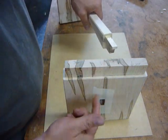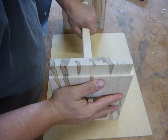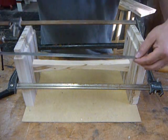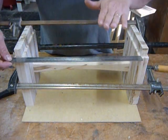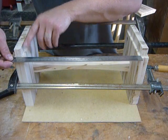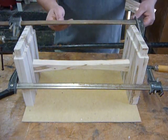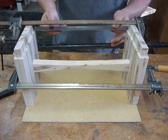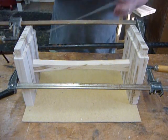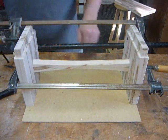With a little bit of glue on our tenons here, we're ready to put them into the legs. Put a little piece of tape on the outside to protect it. Once we get it pushed on here, we're going to add some clamps. With a couple of clamps on here, I want to make sure it's parallel and also flat down onto the table. I'll check in between the tenons — on this side we're at 14 and a sixteenth; over here, tenon to tenon, about 14 and 3/32. I'm going to crank this one down just a little bit. 14 and a sixteenth on both sides — we'll let it dry and then glue on the top.